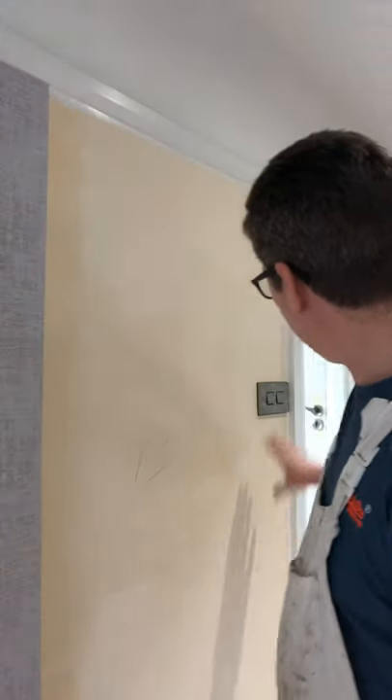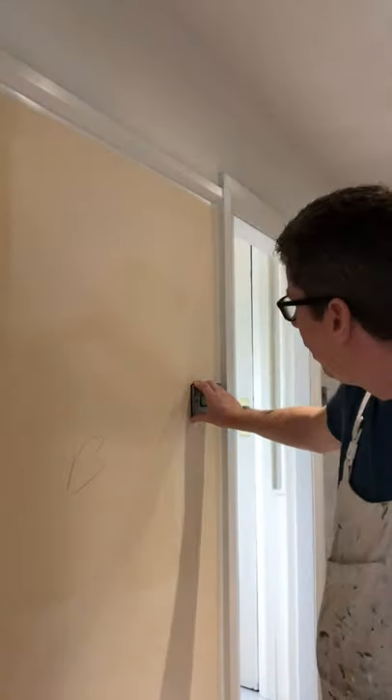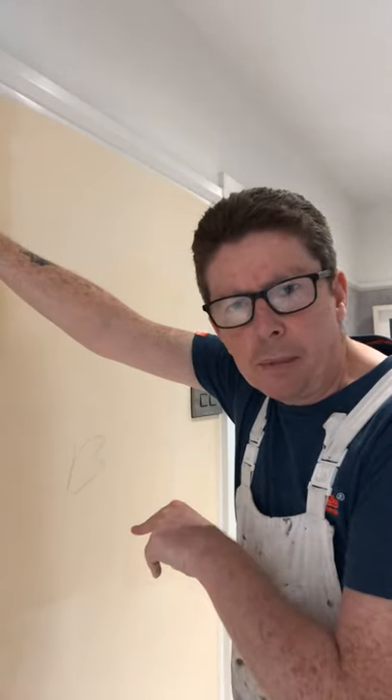So here's your socket here. You don't have to take the whole socket off. A lot of people try it themselves - if I was getting sockets removed I'd have an electrician in to do that. But you do not need to take the whole socket off. It's silly. You're better keeping the socket on the wall so you can get the right measurement for the paper going around the socket. All you need to do is loosen the socket a few mil and allow a few mil on your paper to tuck in behind it. That's all.